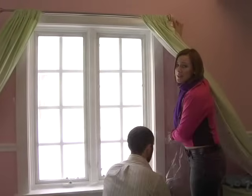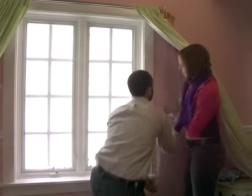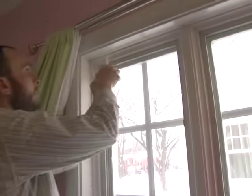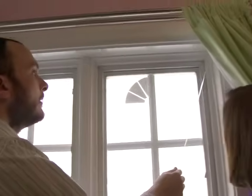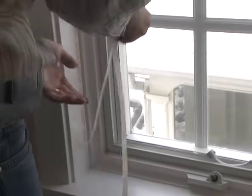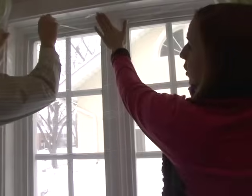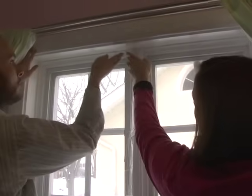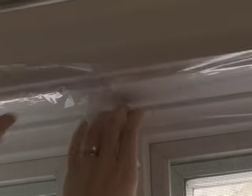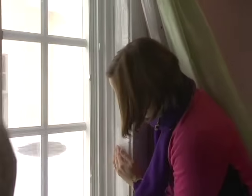It's always good to have a partner when you're using this plastic because it can be rather large. It's also important that when you're putting it up, it's nice and measured, so you don't have too much extra that you're cutting away and possibly pulling away from the adhesive later. Now we're pulling away the backing on the tape — carefully. When you put the plastic up, it's really helpful to start pressing in the middle and work your way out to help prevent any gaps or sags. You don't have to worry about it not being super tight, because that's where the hair dryer comes in — to make the plastic tight as a drum and super clear, so it looks like a window.